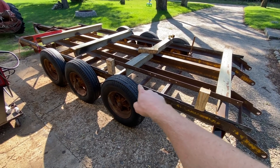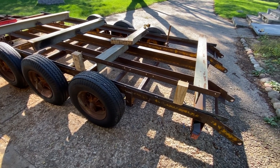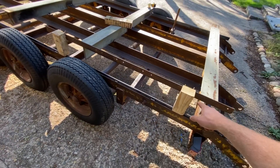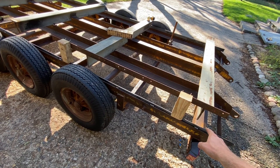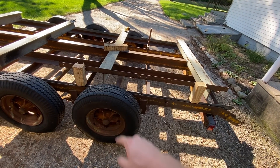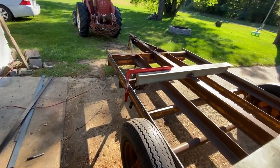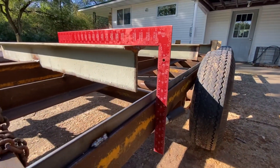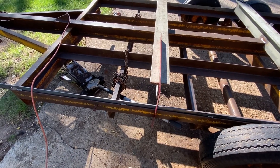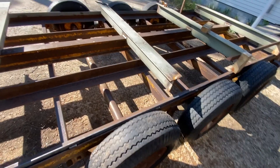I just got done welding the rails on here for the carriage to roll on. The way that I did this, to make sure that it's parallel with the bed, I measured five and a half inches down, which is where I wanted that rail to sit, and drew a line on these blocks here, and then screwed them onto this piece of angle, and got it roughed in so it was all roughly level. Then I took my square and set it on here and made sure that it was at five and a half. I had some C-clamps on there, clamped it all down when it was in the right spot, and then stitch welded it along there. Same on the other side.